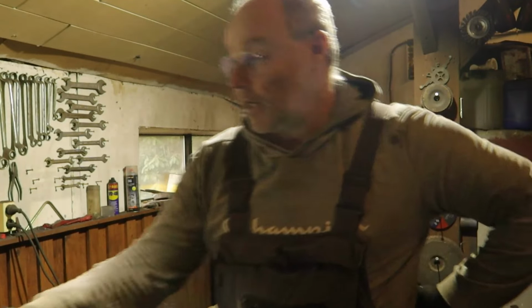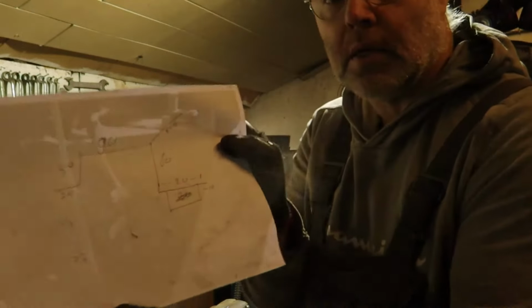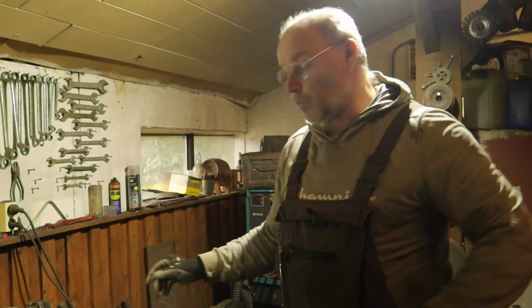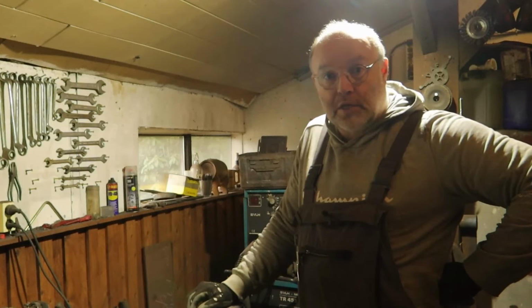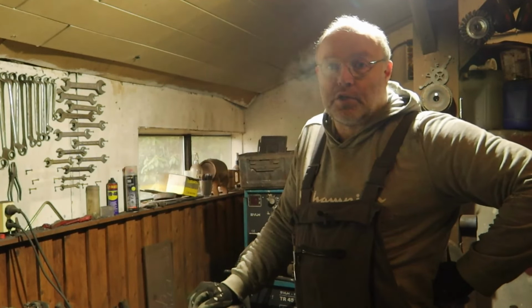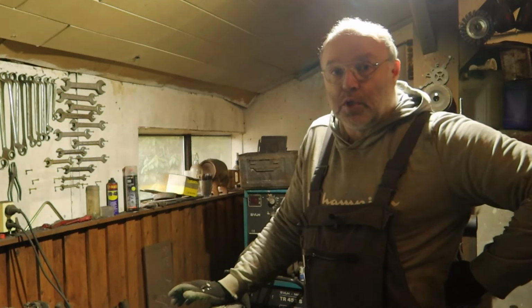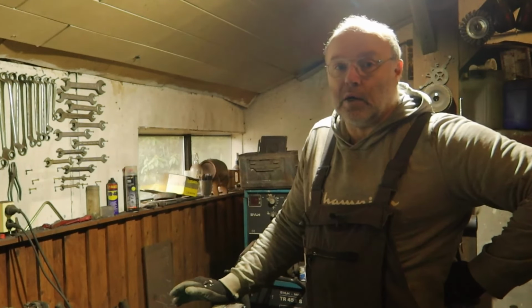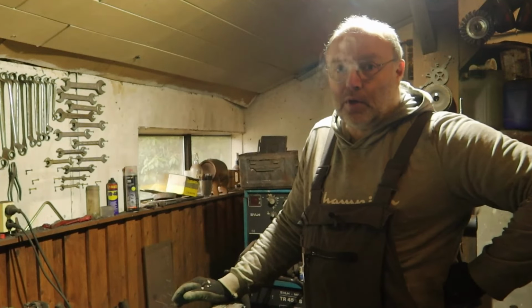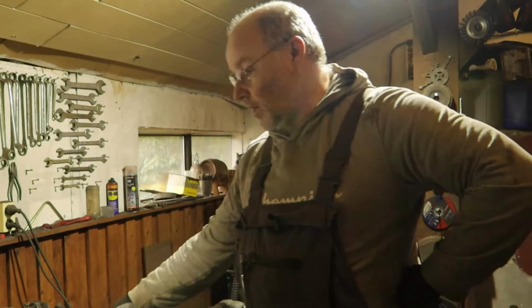And I also made a rough sketch of it. I don't know if you can see it. It's a bracket for supporting the weight of the driver when he gets in the vehicle. Underneath will be two hoses for the cooling oil for the steering diff. That's not the original part, but since we use a different steering diff, we have an oil canister for the cooling oil, and stepping on the hose in time will degrade them, so we have to protect them. I'm going to make a bracket for that.